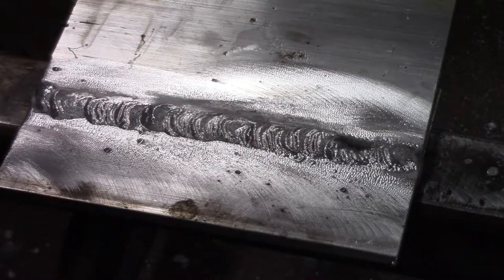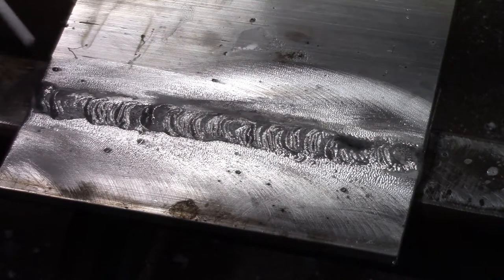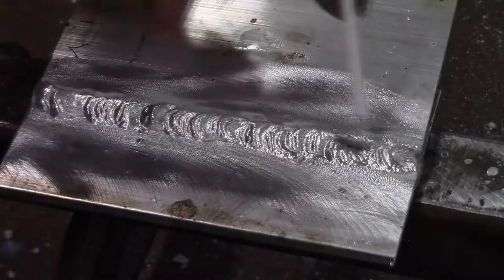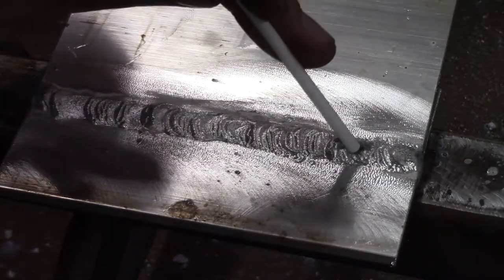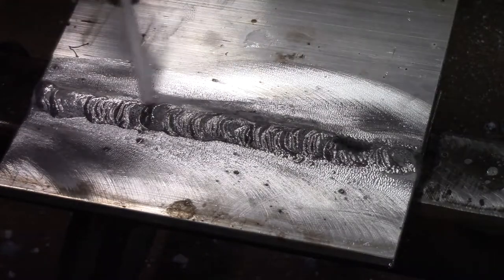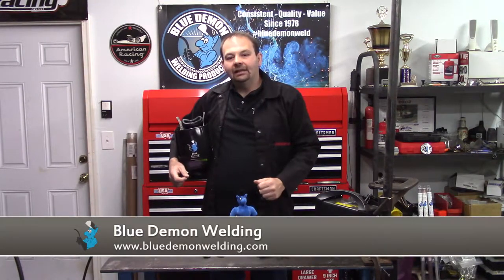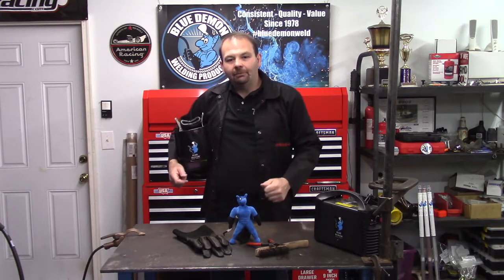This is how the bead turned out. I am decently satisfied with the way this turned out at my skill level. There's a little bit of overfill right here, a little bit of underfill right there, and a lot of underfill near the end before I stopped. This particular spot is really bad — a lot of underfill here, this would need to be ground out and re-welded. But I got the corners pretty good, and this one spot, even though it has a little bit of underfill, is not too bad. I really appreciate you spending your time with me today. Please remember Blue Demon for all your welding needs. Thanks for stopping by and I'll see you next time.